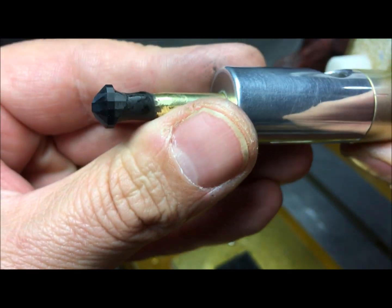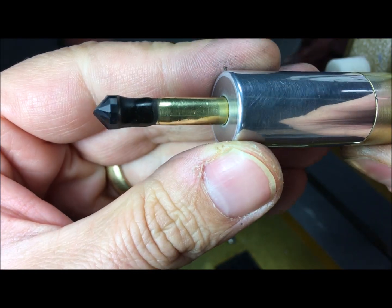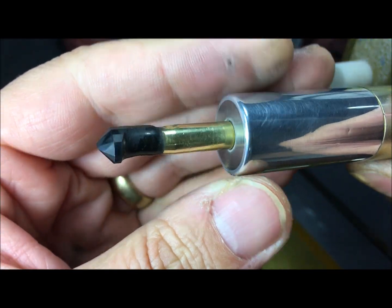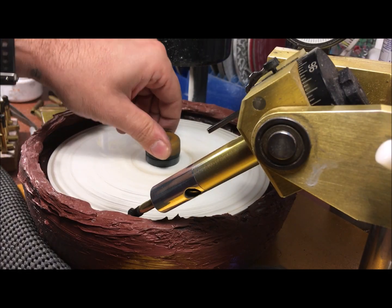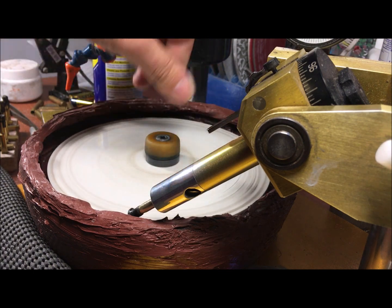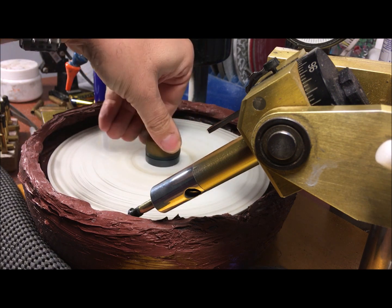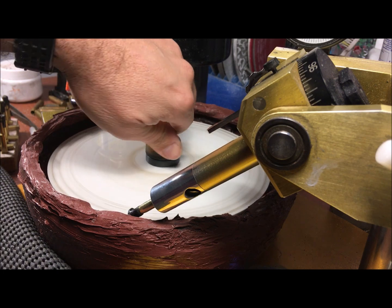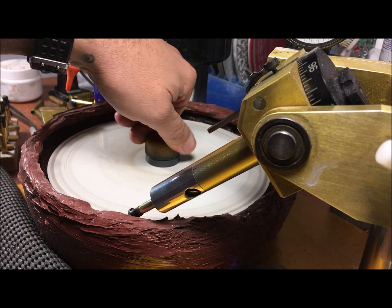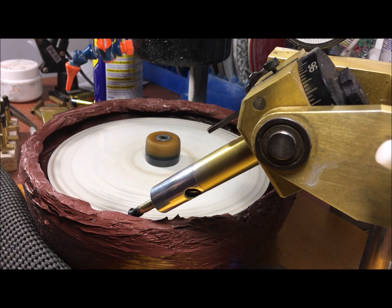Okay, this is with the pre-polishing done at 3000 grit. Now we're just gonna polish it, and then we pass at the top. We're gonna polish it using a ceramic lap charged with 50,000 diamond grit and some lubricant. I'll show you now a video on how to prepare a ceramic lap for these purposes. So let's do it.